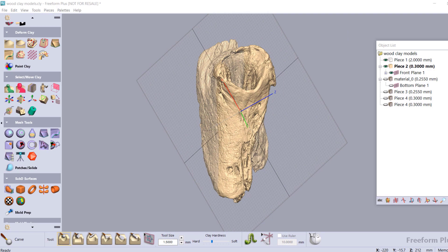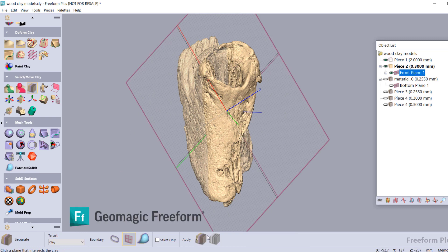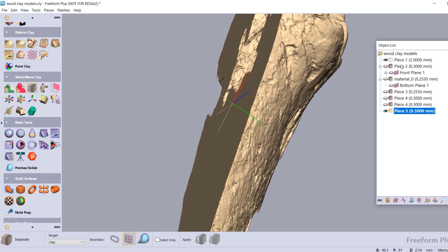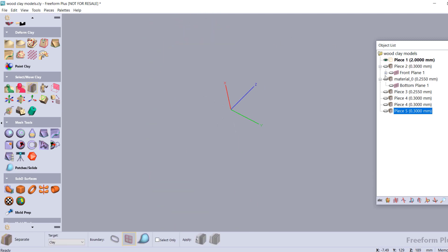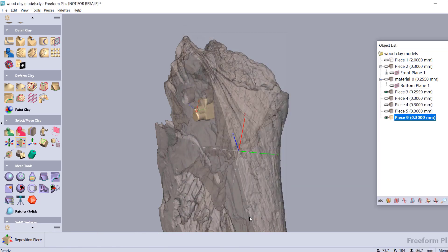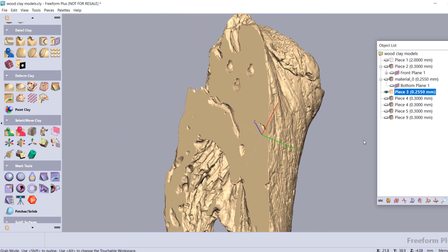The last thing I'd like to do with this mesh is make a version that has some mounting holes on the back. If you've ever worked with mesh data, you know it's pretty hard to edit since it's not a solid body. The software I prefer to use is Geomagic Freeform, since it converts mesh data into a clay-like body using voxel information. I can then sculpt features onto this mesh or cleanly remove sections of it using planes or other inserted primitives. From here I can create a plane to cut away a section of the wood to give me a flat face, then add mounting hole features by combining simple primitives and placing them in the desired location on the back. Using a boolean command I can remove these from the main mesh, and because it's a voxel body everything smoothly combines together. From here I can add finishing touches and re-export it as an STL for printing.